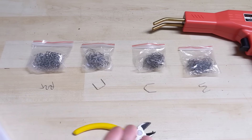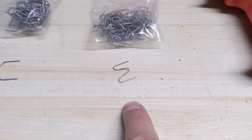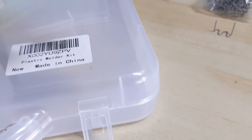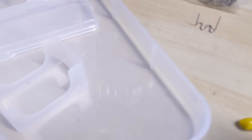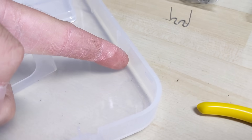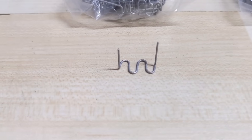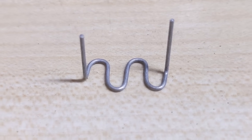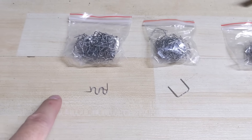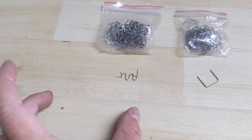There are four different kinds of elements. Starting with the outside corner: it forms a V, used to fix a crack on the outside of an edge. Next is an inside hot staple where the V point faces out, letting you sink it into the inside of a piece of plastic. Then there's a straight one. Finally, the most-used one is a wave — it has so much surface area from waving back and forth that it holds the crack in both directions.